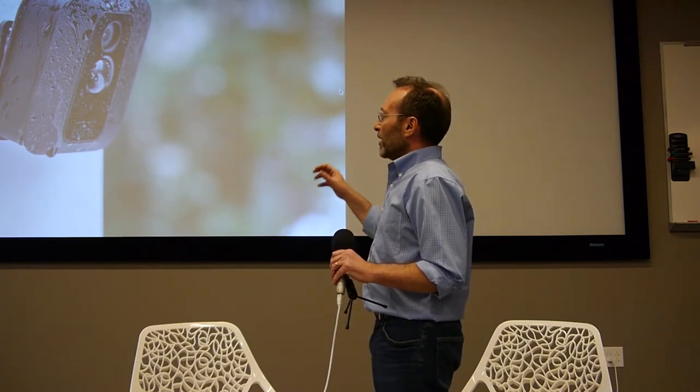So we built a waterproofed camera. At night, it actually uses infrared illumination, and we pull a mechanical shutter out of the way so the infrared light can hit the video sensor — during the daytime you don't want that to happen. People wanted infrared because they didn't want you to know you were being filmed. On the original camera we used a white LED flash, and people hated that. We also had a little blue LED that lit up whenever we were recording, day or night, so you'd know you were being recorded — and everybody hated that too. In fact, the most-watched YouTube video about Blink is how to take a drill and drill out the blue LED on the white camera.